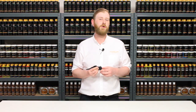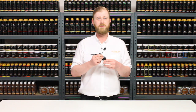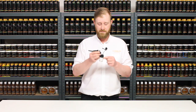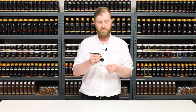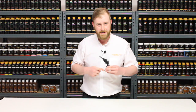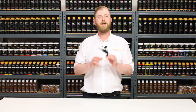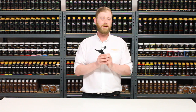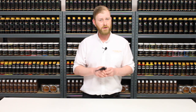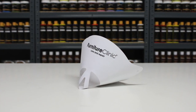It's a simple tool and not much can go wrong. However, some people do run into problems — for example, it could start spitting, or it works fine and then stops again. First of all, check the product and make sure you've got enough product in there — fill it up. Also check the little siphon pipe: simply take it out and spin it around so it's facing the opposite direction, and you'll get a constant flow. If you're still getting spitting issues, it may be worth trying a paint filter to strain out any particles or dust which may have fallen into the product. A filter with 190 micron mesh is the best type.